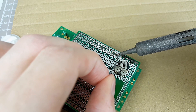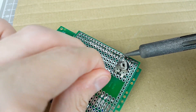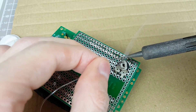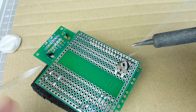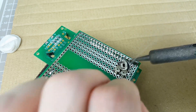Some of these pins could probably do with a little bit more solder, but that's okay — it's easy to go back and add a little bit more. This pot makes it a bit awkward to get to those last pins, so it's usually a good idea to place all your parts down first before you solder anything, just to check for any obstructions that you might run into later.